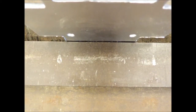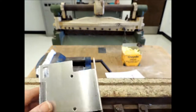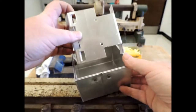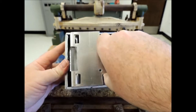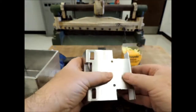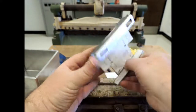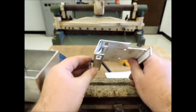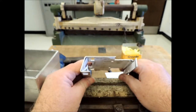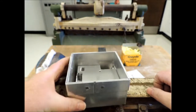I'm just going to bend that to 90 degrees. You can see I've bent it so the width of my aluminum just comes inside. I'm going to hope this fits inside my box. You can see it is a very snug fit, but it's good enough. Just by adjusting on the fly for that back edge, you can make sure it fits in the box perfectly. I actually bent back here about a sixteenth of an inch before that line. First try, I got it in the box!